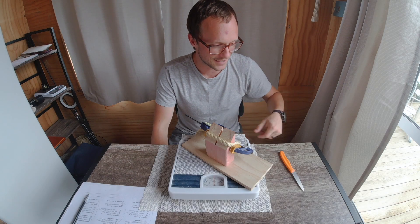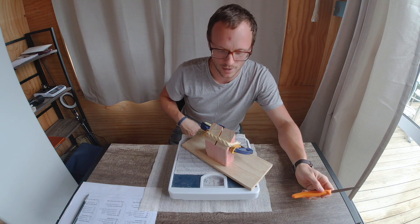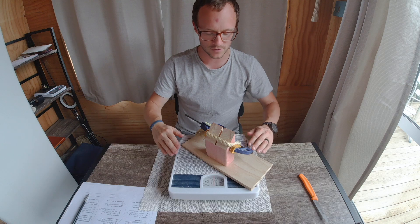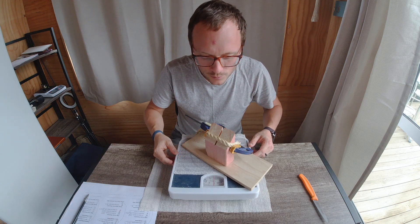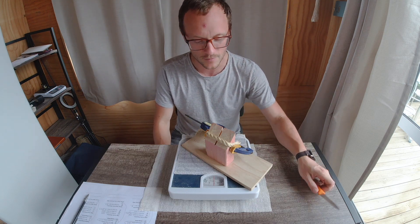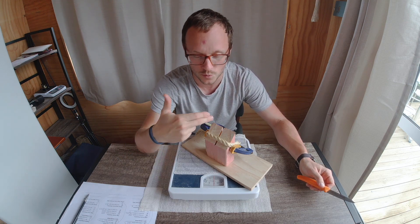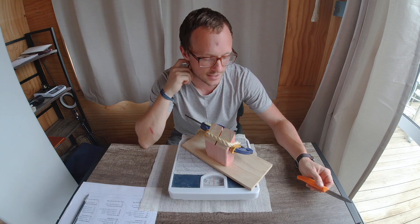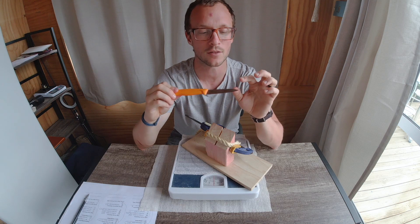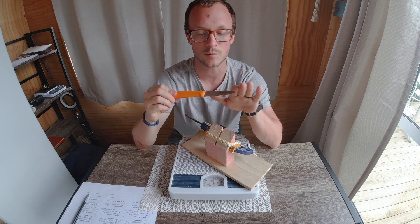Welcome back to the Home Slice. I've been doing this testing — some of you will have followed along — where I slice through nine millimeter sisal rope against a 45-degree wedge with a scale calibrated to zero to analyze how much forward pressure it takes to convert into downward pressure, measuring slicing aggression of different edges. I've tested fine edges and coarse edges, and now I'm going to compare them to some dual grit edges.